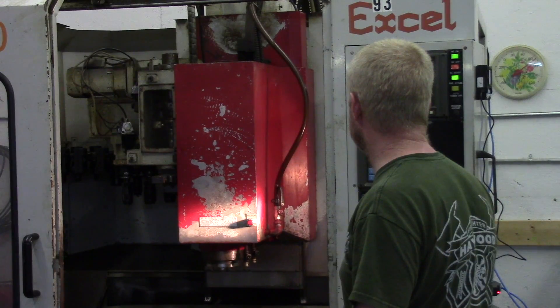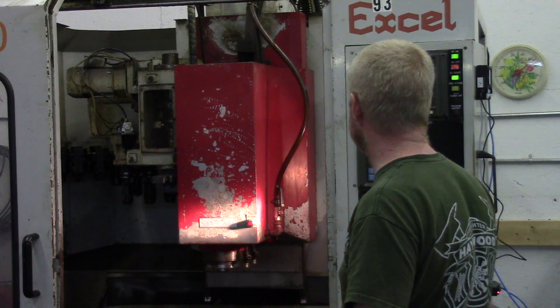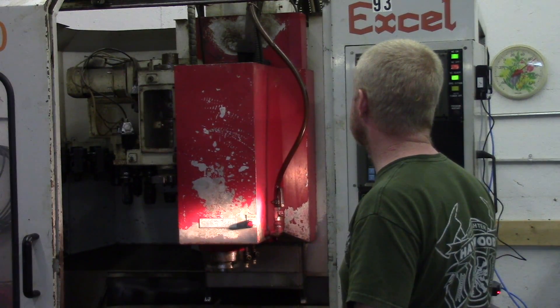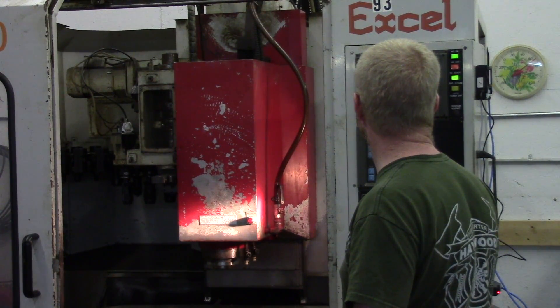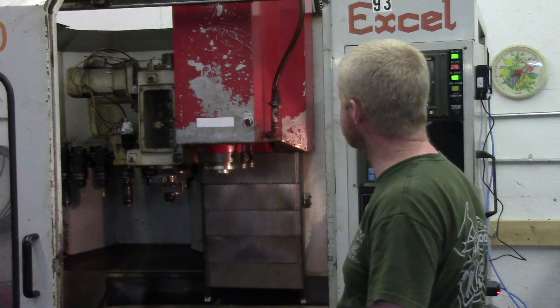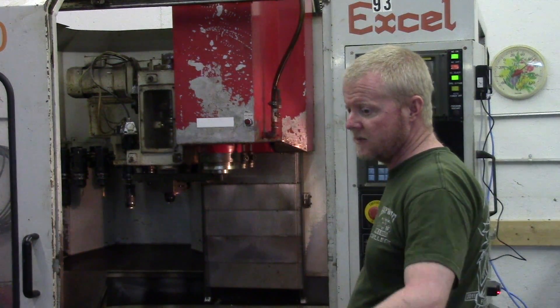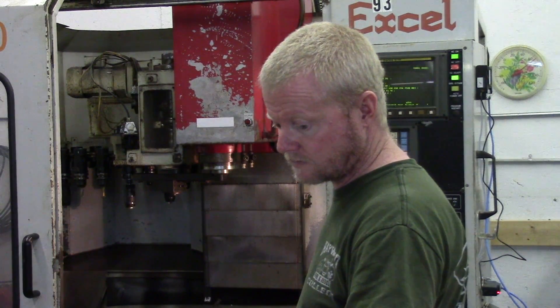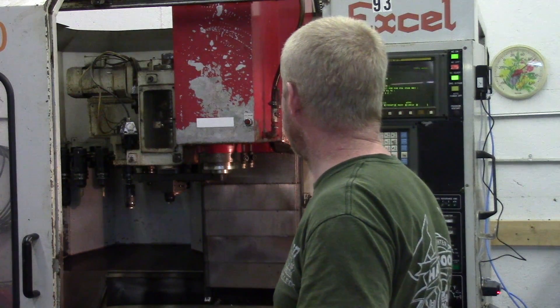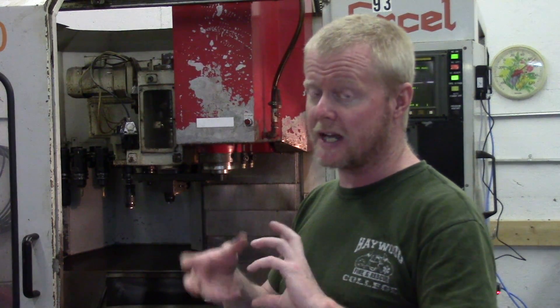You can make a small machine real quick. Now we're going to attempt a tool change again, which is more than likely going to fail. I'm not sure whether I'm not doing it right according to the manual, or there's actually something wrong with the tool changer. There are some LEDs on the automatic piston, so those limit switches seem to be working. There's a whole other set of limit switches on a cam on the side of the tool changer that may be causing the problem.